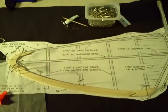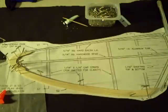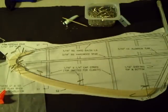What got me was where the red control horn is pointing — it says shim the trailing edge and outer edge 3/32 inches, but then up at the top of the plan it says to shim it 1/16th. I was sitting here doing the calculations, putting this stabilator together in my head, thinking: why on earth would you shim the rear more than the leading edge? Couldn't figure it out, so I got on the forums and finally someone named John responded.